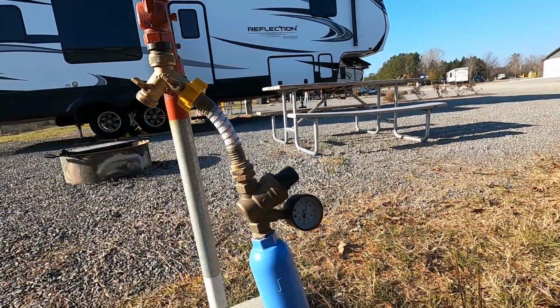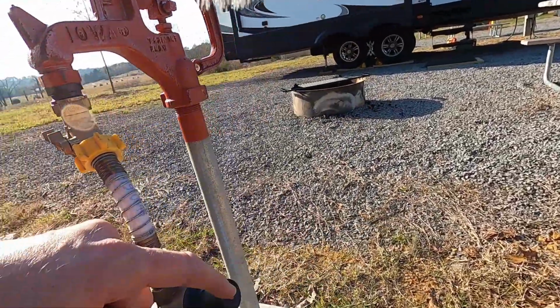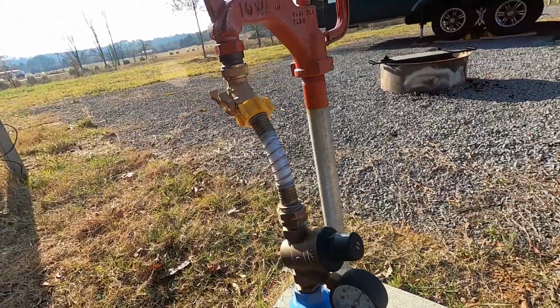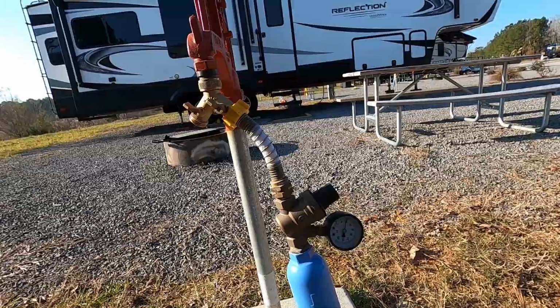We bought an adjustable water pressure regulator, and I keep it between 45 and 55 psi. Showers, everything is awesome now. And here's what one of those looks like. You can use a flathead screwdriver to adjust higher or lower pressure. It was a huge difference. Highly recommend an adjustable one.